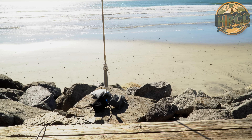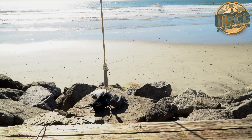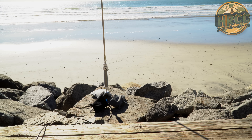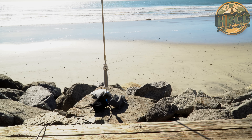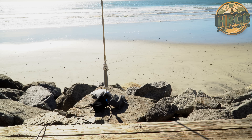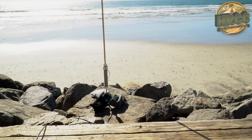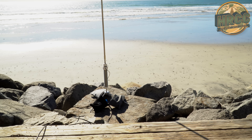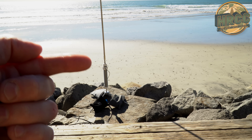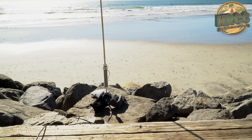The namesake of the Wolf River coil is this metal coil PVC contraption at the bottom of the antenna. It has three legs of a tripod and three radial wires that it ships with. I have an older model, so my tripod legs are a bit short — I recommend getting the longer tripod legs, as that's a better platform. This chameleon whip takes the resonance down to 40 meters with very slight adjustment of the coil, and you can see only a couple of those loops are engaged right now. It's resonant in the phone portion of 40 meters.